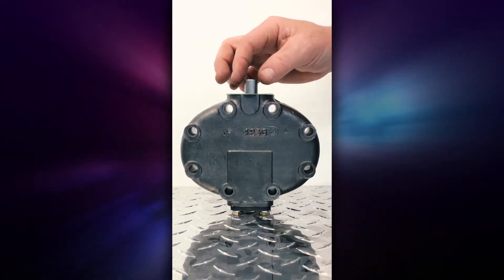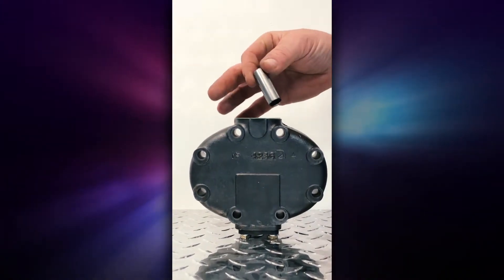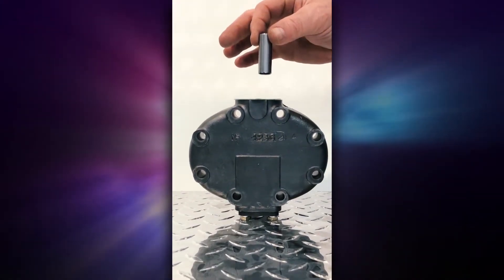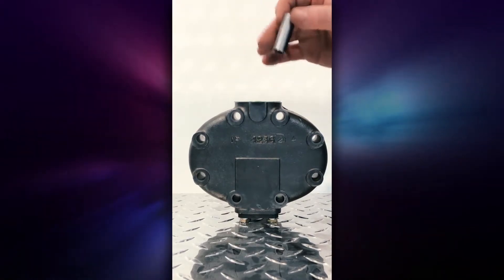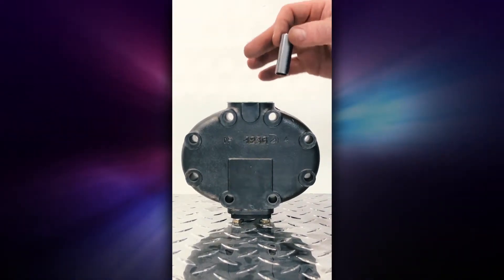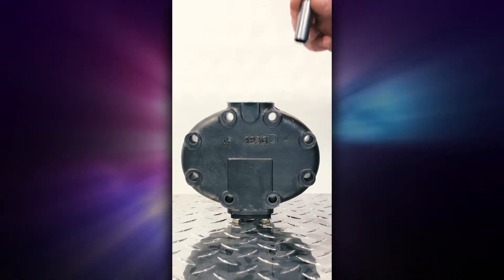Upon removing the plate, you then pull the center tube out — this is the thrust tube that is putting pressure down because the spring is forcing it out. When installed, this locks the head in full capacity and will not allow it to unload. Removing this turns it into a capacity control.